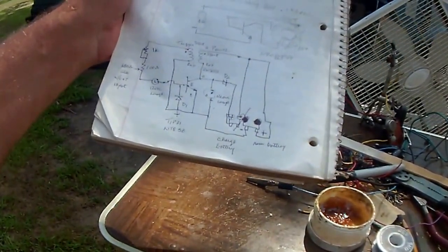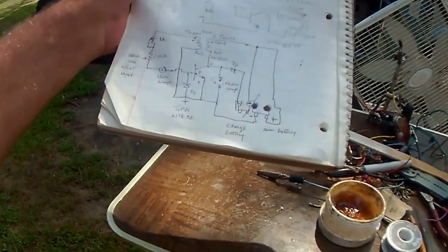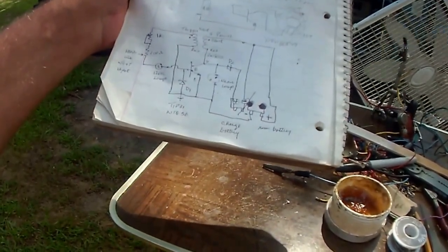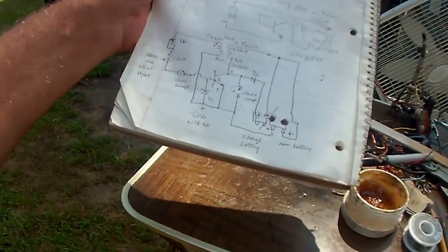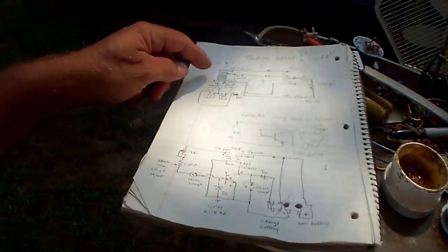You got to make sure the start wind and end winds are correctly connected to the rest of the circuit, and the diodes are in the right firing order. I'm using the 2K to 5K pots with a 470 ohm resistor with the trigger coil.